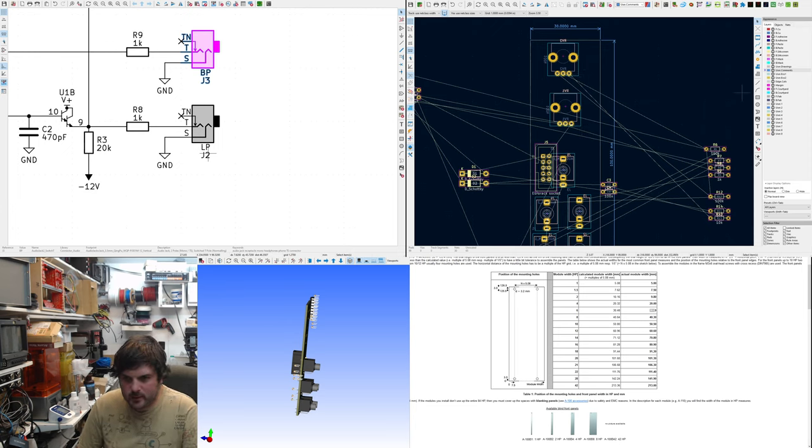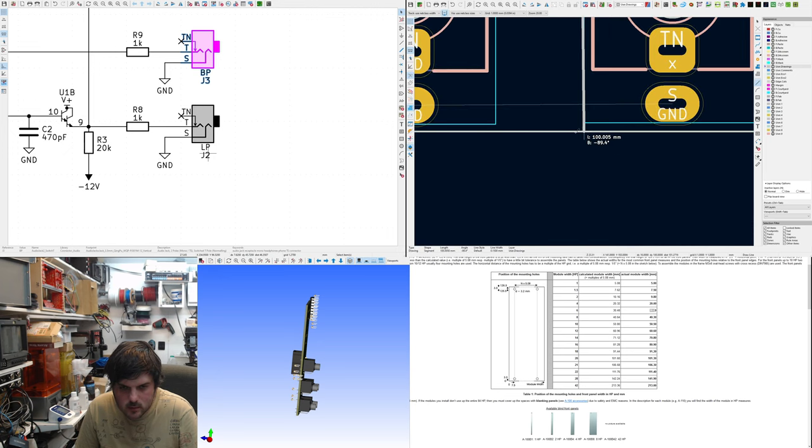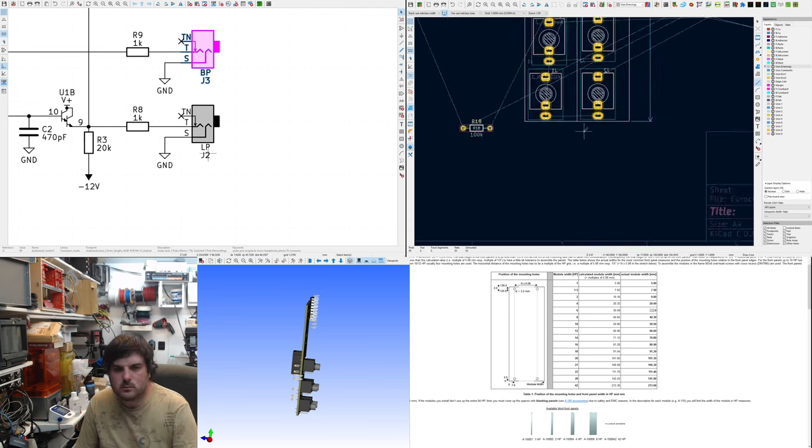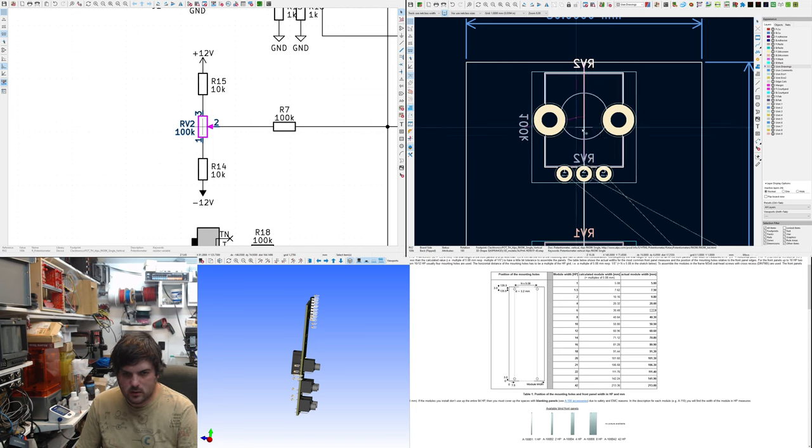Now I want to add a guideline. It's quite handy to put in guidelines, even though KiCAD really doesn't have one. If you hit spacebar, I don't know if you can see down here, you can see the distance from where you just hit spacebar. So I've done it 15 across. Put in this central line. It's just a guide to show. And then when you don't want to see it, you can just turn it off, you see.